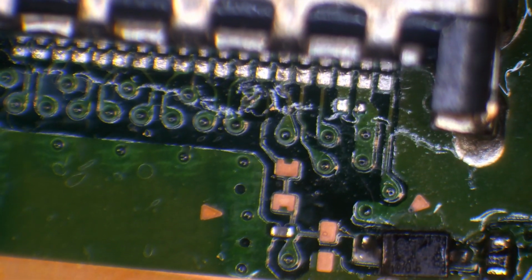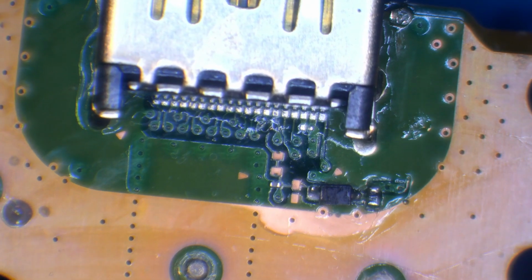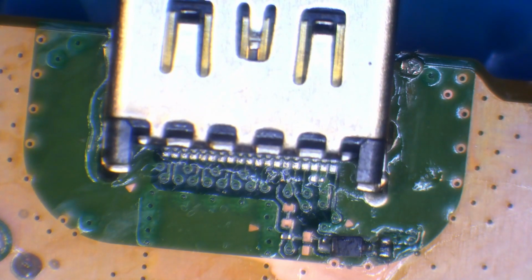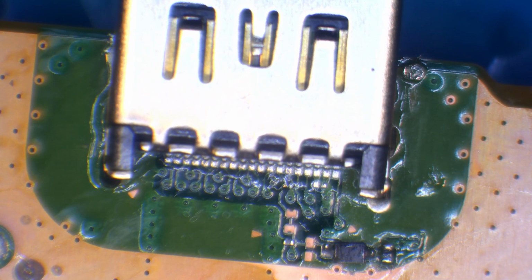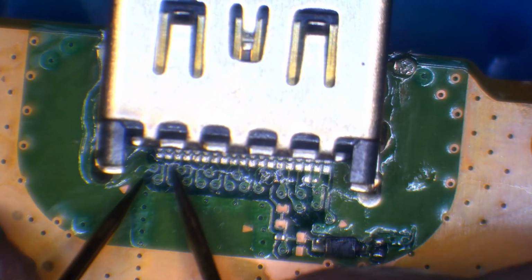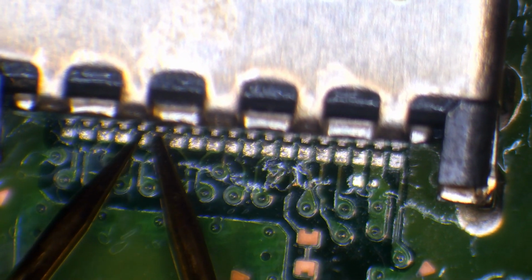That cap's just a smoothing cap on the 5 volt line, that's fine. I'm not really worried about that, to be honest. I don't think we have any shorts because we're getting good diode readings, but let me just check for shorts. But apparently this worked after the port change, so I can't see it having any shorts. Nah. No shorts.